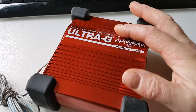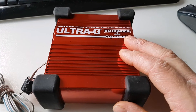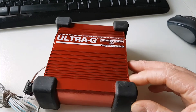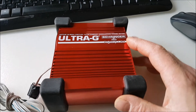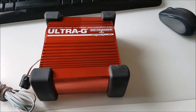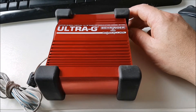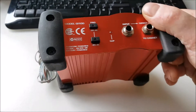How does this lend itself to amateur radio? The way these things are configured inside - in the case of this one, which has the OT1 transformer unlike the one Cal showed - it provides full galvanic isolation on both input and output. It's connected but not physically, done through transformers. This is the last piece of equipment that my audio signal goes through before it gets to the radio, to isolate every piece of equipment away from the radio in case there's any RF getting into any of the cables.